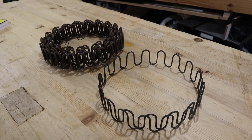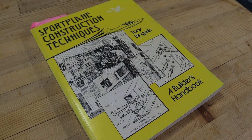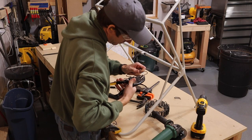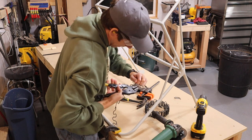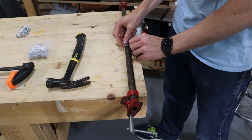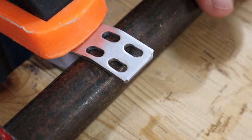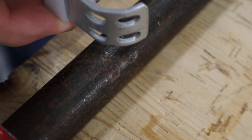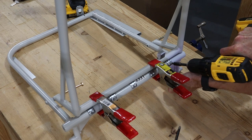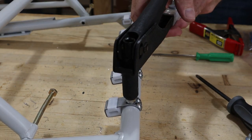There are many methods for doing this, but we ended up choosing zigzag springs, because in one of Tony's books he said they might be the best option. I know some people drill two holes and hook the springs through them, but this was proving to be more of a pain than I wanted to deal with, especially since I didn't have a torch to make bending the springs easier. So I bailed on that method and purchased some spring clips. The ones I got were made to go on a flat frame, so I shaped them around a piece of pipe before attaching them to our seat frames. After they were shaped, I attached them to the seat frames — in most places I used screws, but where the front seat backs meet the lower frame I used pull rivets because truss head screws would have interfered with the lower bar of the seat back.